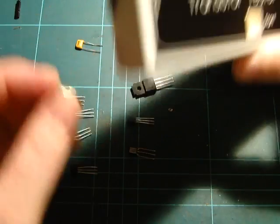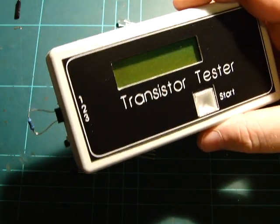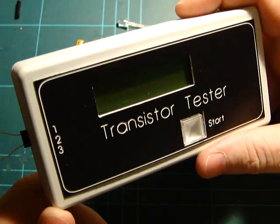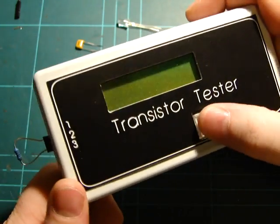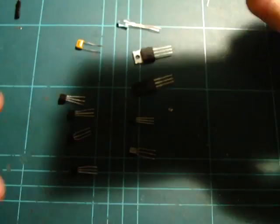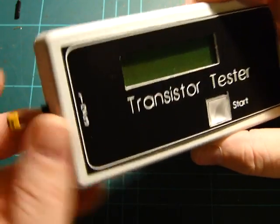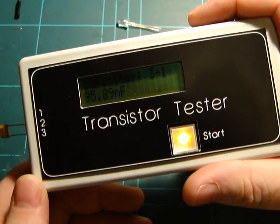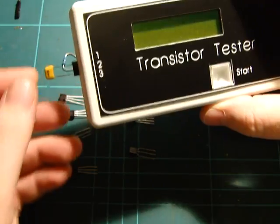What's also funky is if I grab a resistor — I haven't put the right firmware in that has the custom characters for the ohms symbol and stuff, so there'll be a random garbage character. But I put in what I think is a 10K resistor, hit the button, and it says 10K — pretty close; the resistors are fairly accurate. The capacitors, which I'm about to try, apparently you shouldn't really rely on, it just gives you a ballpark. That's a 100 nanofarad cap and it reads 95.89 nF — it'll get you out of trouble, it's more useful for order of magnitude than exact values.